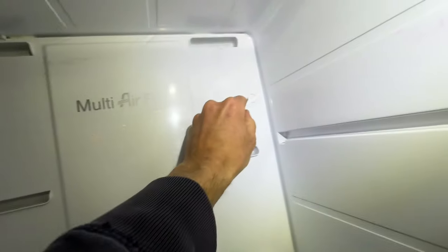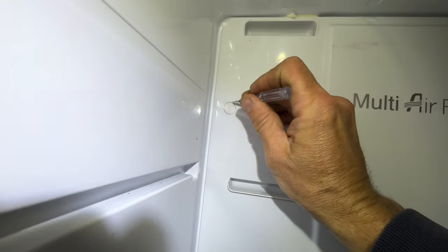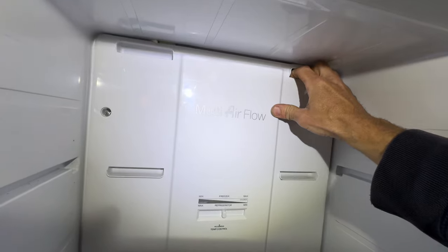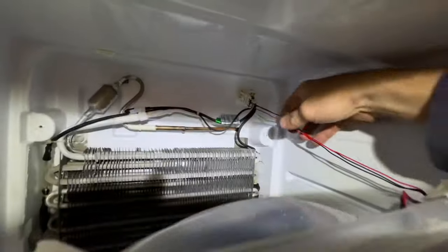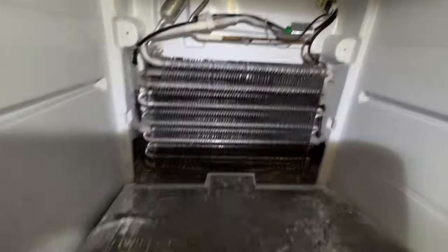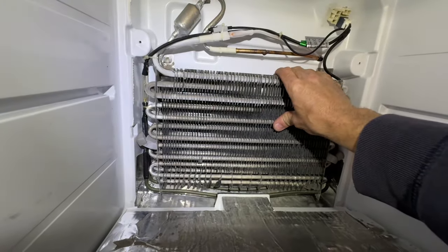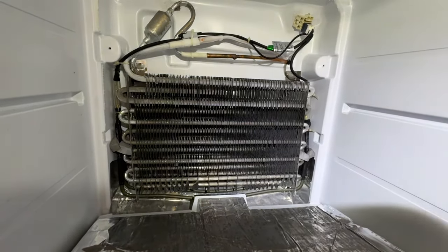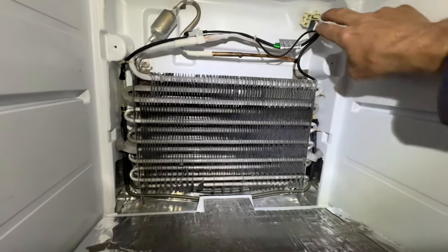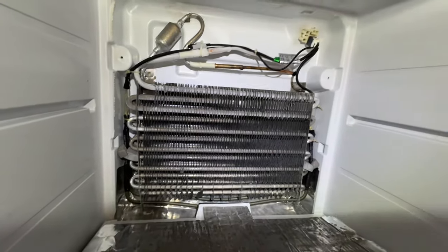With the drawer out I can get in here, and there's a Phillips screw back in there. Now I can pull on this panel, flip it forward. There's a wire harness in here so I'm going to reach back and unplug it - there's a little locking tab that I pressed on. There is the fan, spinning down now that it's unplugged, and there is the A-coil, which is getting cold since it's running right now. I left it powered up because it's only 12 volts and I needed to be able to test for voltage here, which is the next step.